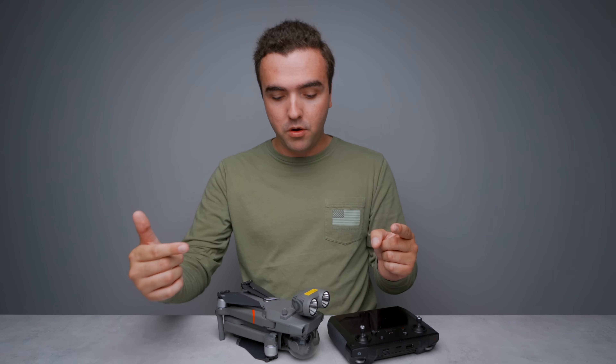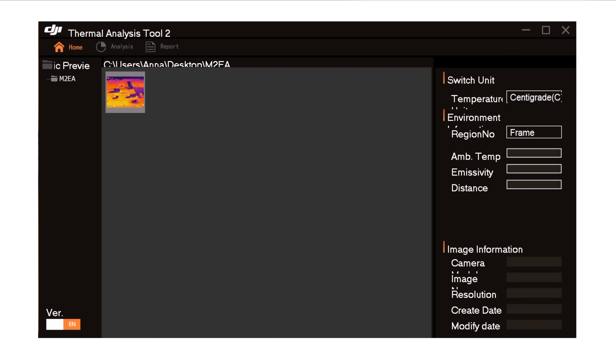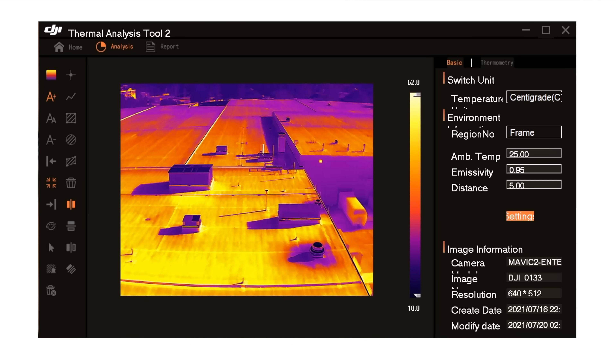This is really important to mention: the thermal sensor is radiometric — it stores all that radiometric data. Because it's not a FLIR camera, you can't use it with FLIR tools, but you can download DJI's new Thermal Imaging Analysis Tool 2.0, which is designed specifically for the Mavic 2 Enterprise Advanced camera. Just a warning — it still is a fairly early build, and while all the functionality is there and it works well — changing color palettes, adjusting heat tolerances, plotting points to extract heat information — I found it to be a little buggy. Notably, the previous thermal camera on the Mavic 2 Enterprise Dual was not radiometric, so it didn't store all of this data to be accessed at a later time. This further separates these cameras aside from the much-needed upgrade in resolution.